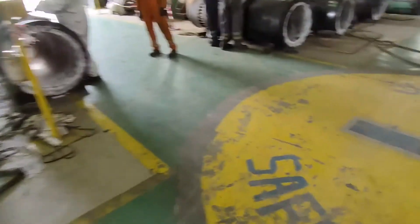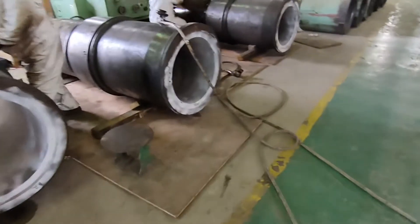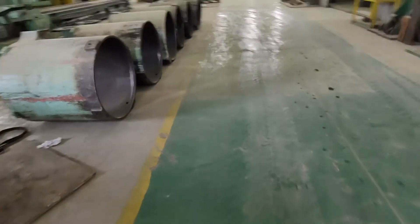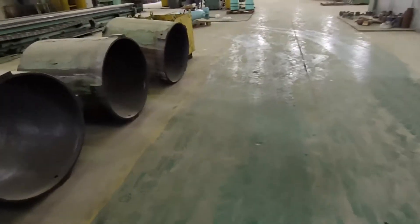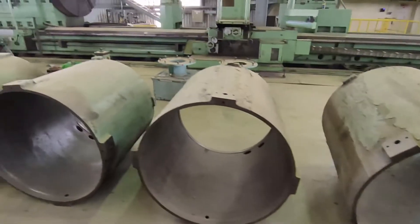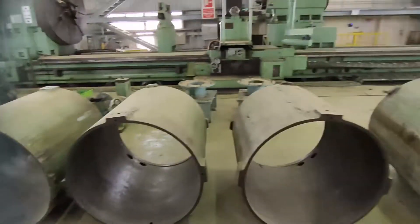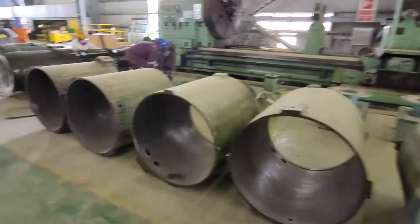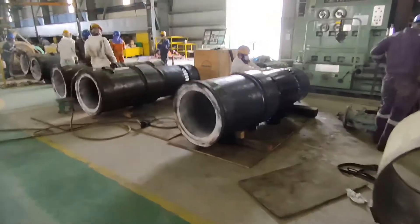This part is the liner. We have five liners being cleaned. They're cleaning the area where the O-ring will be installed. And also there, if you can see the white color on the inside of the liner, it was a dye test. This is some of the jacket housing of the liner. As you can see they already stand by here and it will be cleaned later on. This is a complete set. The engine components are being brought here to the shipyard workshop and they're trying to clean it and make sure that everything is good.